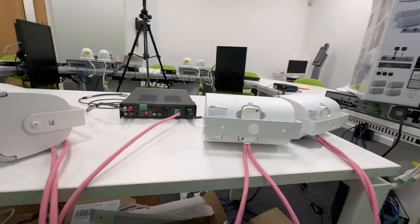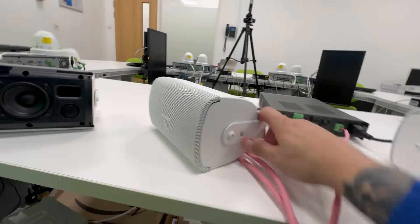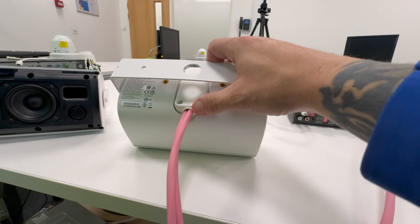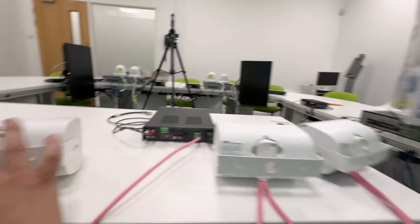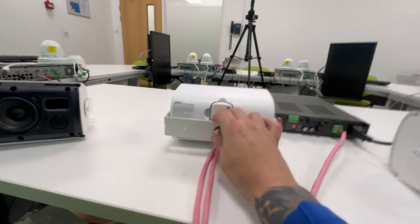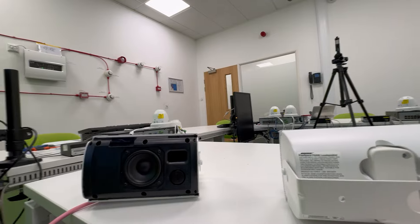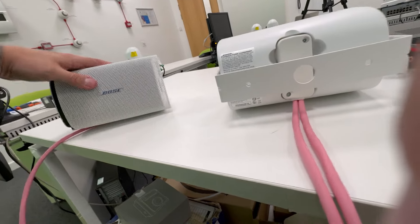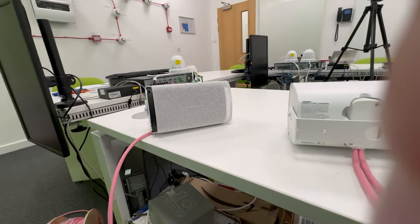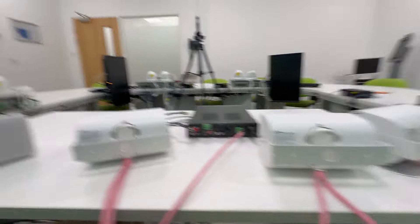You can adjust the tapping down, or there's an adjustment to make it a 16 ohm speaker should you require. So four speakers in the kit, all white, all with bracketry fitted. The cable goes through a rubber housing push-on connector — you have an in and out for 100 volt line so they go in series. A rubber cap keeps it waterproof and weather resistant. The last speaker on the line has the grill ready to fit: align the locator lugs, slide it along, and it clicks in. Done.